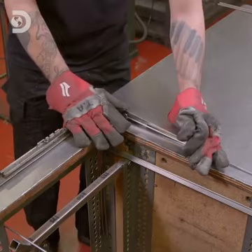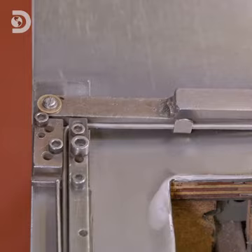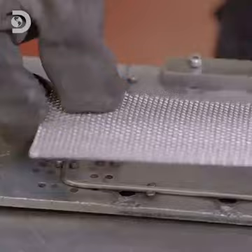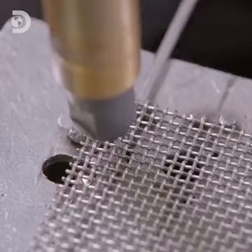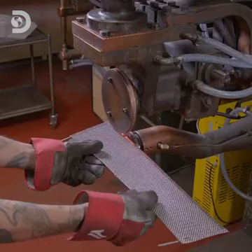Next is the side piece of the mask. First, steel wire is bent into a rectangle. This is then placed in a fixture, over which a piece of mesh is added. The mesh is then spot welded to the frame, tacking the components together in preparation for a full weld all the way around, which is carried out using copper welding wheels to fuse the two pieces together.